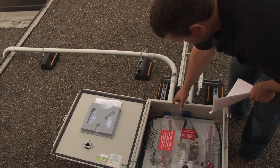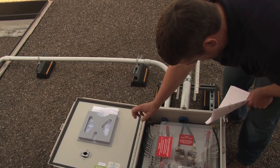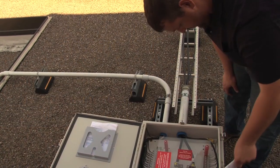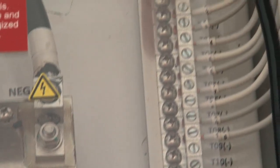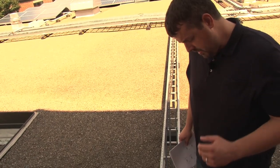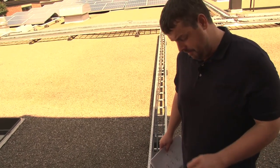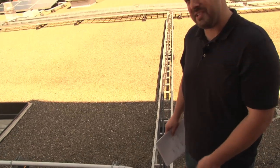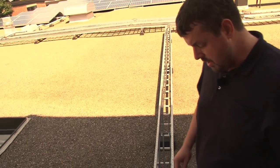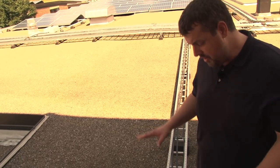Following that, we've got our individual overcurrent protection fusing for our source circuits, which go out to our modules. We're going to look at the wire management. We can see here that this is where the source circuits enter the enclosure. The conductors are protected with a bushing. The positives are terminated onto the fuse blocks. The negatives run all the way around and terminate onto the negative lug strip. You'll notice there are no fuses on the negatives — that's really important. This is a grounded PV system, meaning that if there's a ground fault in the system, that's going to be detected between the ground fault detection device, which is located in the inverter.